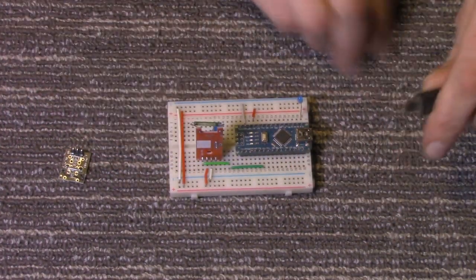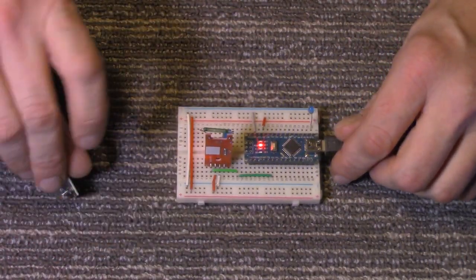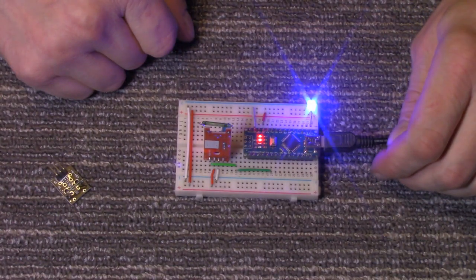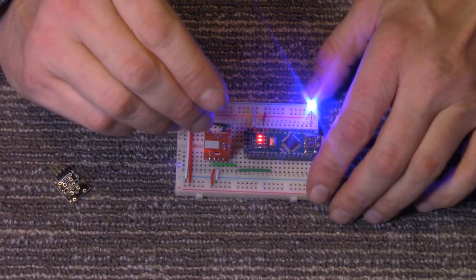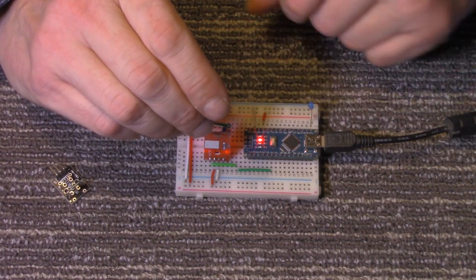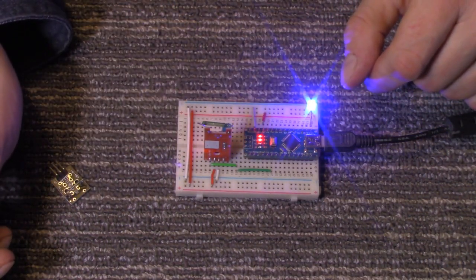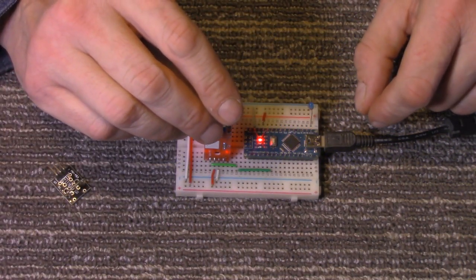Connected. We need some power. And after I show you this one, then we'll go ahead and take a look at using this one as well. There we go. Now I have it here. I just got the LED on. And when a magnetic field is introduced, it makes the digital pin go low. And the Arduino is reading it. It's telling the LED to turn off. You could reverse that and have the LED off and then turn on when a magnetic field comes in close to it.